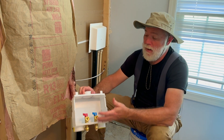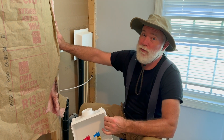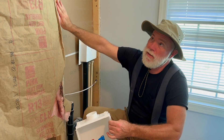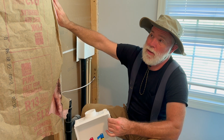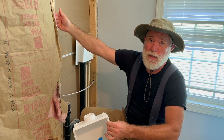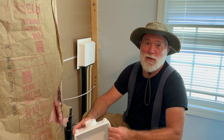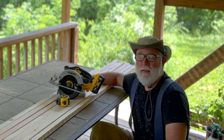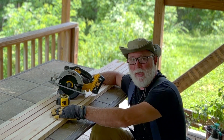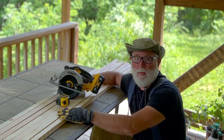The only other option is to literally think outside of the box. This is a 2x3 wall currently, but it can easily be made into a 2x4 wall by adding just one inch of furring to these studs. If I rip a 2x4 down so that it's only one inch thick and then nail it up to each one of these studs, we'll end up with the same space that we would have in a 2x4 wall, and then the box is going to fit just fine. So that's what we're going to do — get busy ripping down some studs. Just a few minutes on the table saw with the rip fence set at one inch and we have a collection of boards that are one inch thick. We'll cut them to length, nail them up on the bedroom side of the wall, and we'll have a 2x4 wall when we're done.